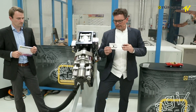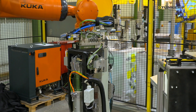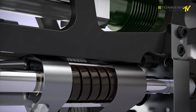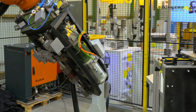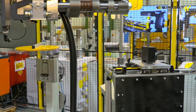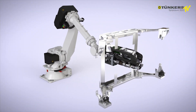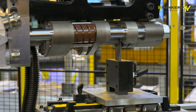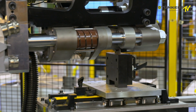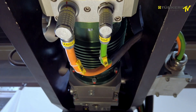Basically, we use the embossing process and the punching process in order to achieve a good connection. In the robots, the tolerance position of the body is measured with a laser system. Correction values are then transmitted to the tong, and the tong will adjust the embossing depth. The embossing depth is then transmitted into the component on the body, which is waiting for the embossing, compensating the tolerances.